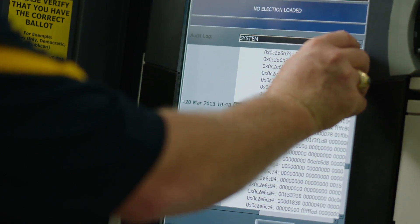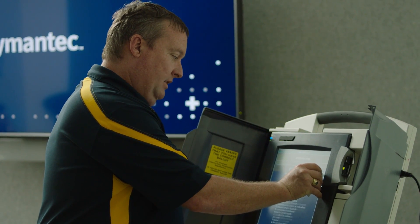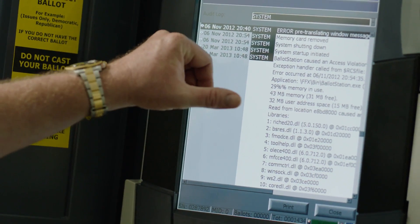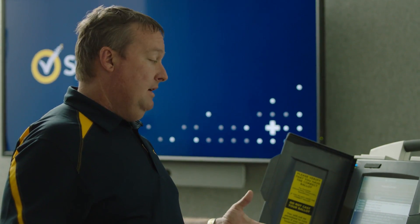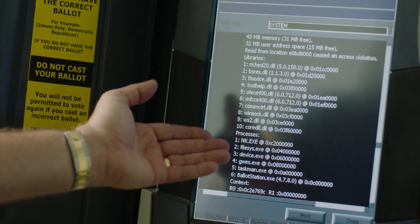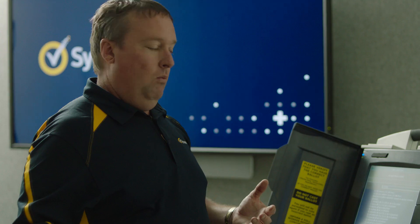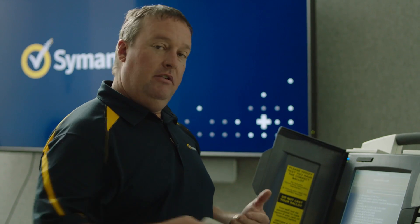Looking through here — whoa, this isn't good. Something threw an error, and with errors you get a lot of information that can help. This machine error log was written in March 2013, however this error was thrown on 6-11-2012. I would be looking at when the election happened — did this error come before the election, during election day, or after? We see things like winsock.dll, so we know there's some communications that can happen here, and toolhelp.dll. These are DLLs associated with Windows components, and with taskmon and similar processes we can look for exploits into these sub-processes.